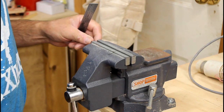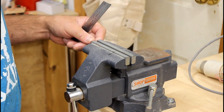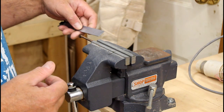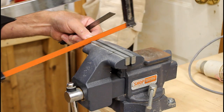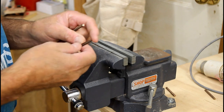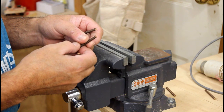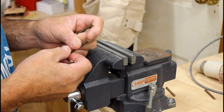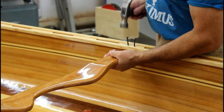So it's time to cut the bolts. I'm going to start by putting the center yoke in first because that's going to spread the center of the boat to the proper beam, and then the seat should fit in properly as well. So I know that the center bolts need to be about two inches long. I'll just throw them in my vise here and give them a quick cut. Once cutting them, you get a bit of a sharp burr on there. So I'm just going to take it to my sander here and just clean up the edges so we don't have any cross threads or anything dangerous for someone in the boat in shorts. So with everything lined up, I can just tap.